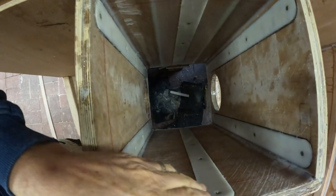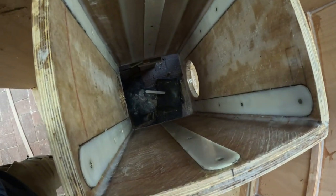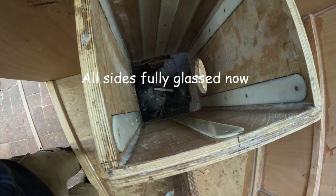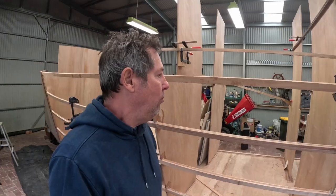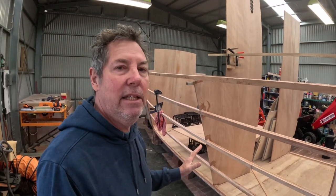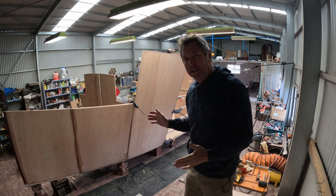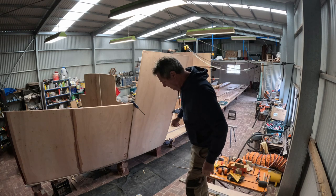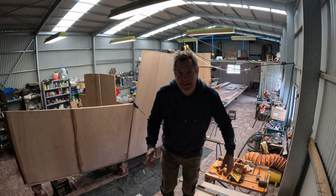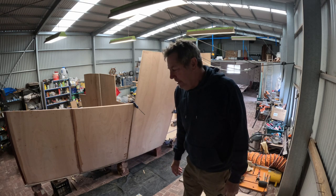I added a rubbing strip — all the other ones are complete. I also added some fillets in the corners, so that just needs to be sanded and that housing is complete, finally. Today I'm going to continue putting side panels on until I get up to the front of the wheelhouse, and then try and complete as much of that front section as I can before continuing back along the boat. It is blowing a gale today so the shed is rattly and it's raining outside — in the middle of summer — but it's kind of cozy in here.